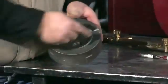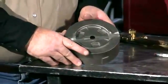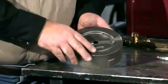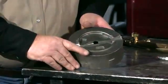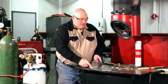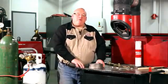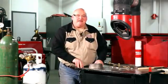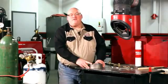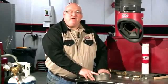On this casting I have an area that is ground out. This crack is in the casting but it's not all the way through. First I have to take a grinder or carbide drill — anything that can remove material — and I'm going to V it out into around a 30 degree bevel to remove all of the crack. Once I get that done I'll clean the material and then add a preheat to the casting. The preheating will allow the casting not to cool very fast, thereby limiting or hopefully eliminating cracking problems.